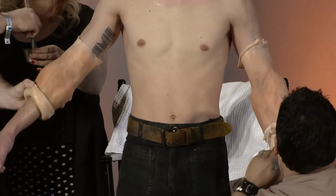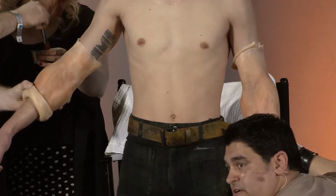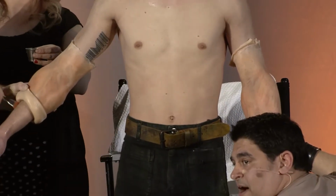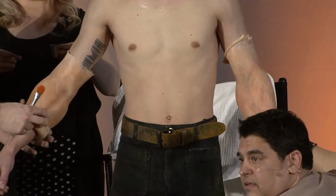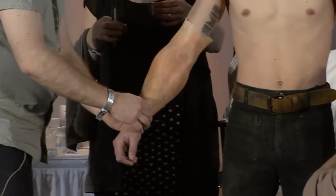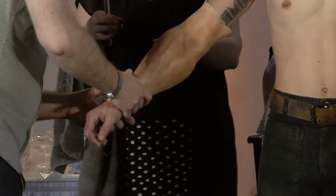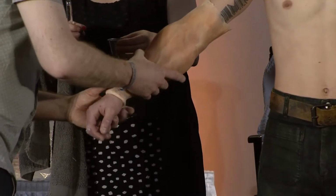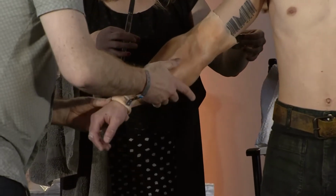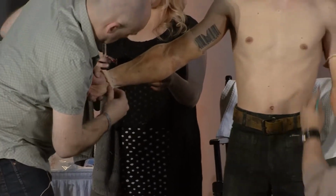So these were all stone molds, yeah? No, I did a recast. The arms were epoxy. They were epoxy and syntactic positive, and then an epoxy and syntactic negative portion of the mold. I was toying with doing a collapsible core and making a one piece, and then I ran out of time, so I said, it's okay, I'm happy with a 2-piece mold. We can seam it. And then these are gel 10. So these are Platsil gel 10 encapsulated with regular baldies.